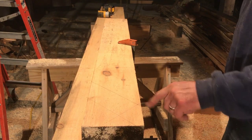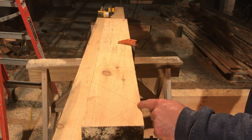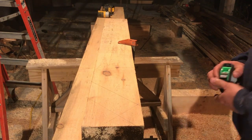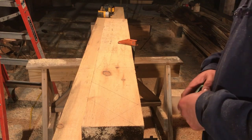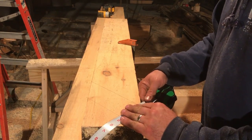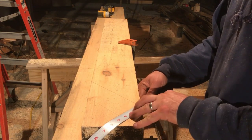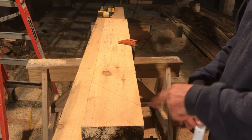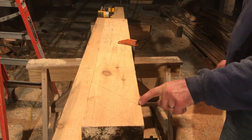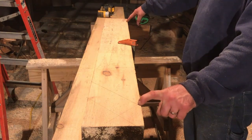So from this point right here — and remember, because we have a half-inch housing, we measured up 3/8 of an inch to account for that housing. Now if you measure across that 45 and you're on 3/8, that's going to be exactly a half inch from that point to the edge on that 45-degree angle. So from that point there to that point there, it's going to be 42 and 7/16 inches.